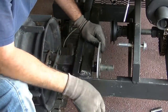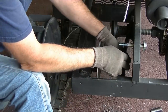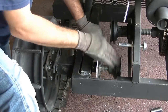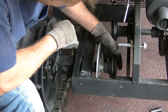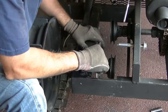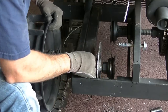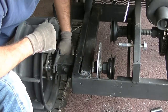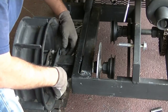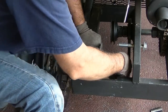Then I have a pulley — these are just regular car pulleys — and I welded a nut onto that. Later I'll drill holes and put a spring pin into the ends to keep them from being able to spin off. By using the threaded rod it does help me align everything up easier so I'm able to position the different components exactly where I need them.